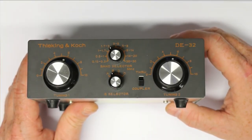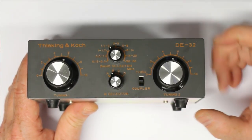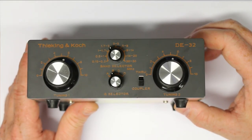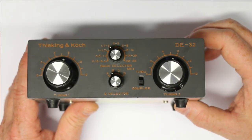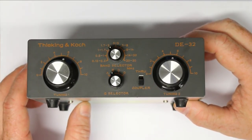Hi, this is Roger from Kanka Labs. Today we're going to take a look at this so-called antenna matchbox, or simply matchbox. We will not only explain what it's used for, but also take a look inside, reverse engineer it, and make a few experiments with a frequency generator and an oscilloscope to see what it really does with receiving signals and what it's good for.